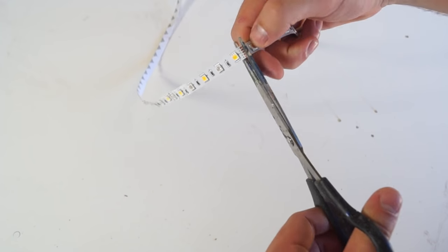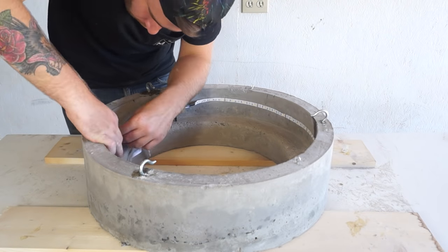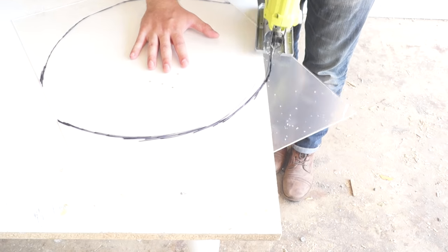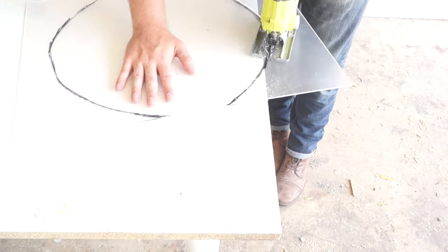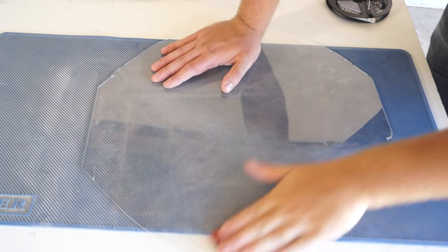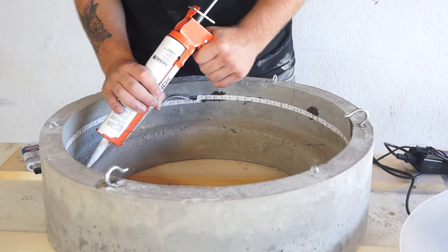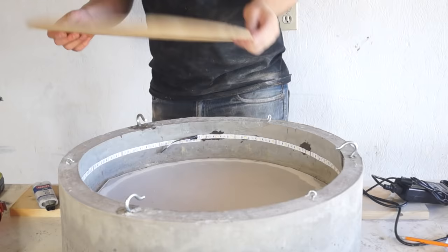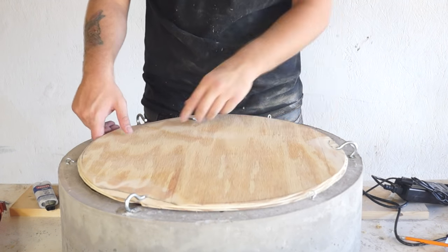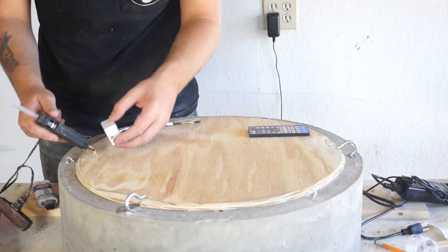While I let that dry, I got my LED light kit from Amazon and installed it — I'll have product links to everything in my written article. Next, I got a piece of acrylic or plexiglass and used a specific jigsaw blade for plexiglass and cut it into a circle. This doesn't give me the absolute cleanest cut, but it was a lot better than using a different blade. I wanted to diffuse the light from the LEDs so you wouldn't see each individual LED, so I used 220-grit sandpaper and sanded each side of the glass. Then I used some silicone caulk and just laid it in and let it dry. I also got some scrap plywood and made a top for the light so all the light wouldn't spill out from the top — it also gave me a place to mount all my electronics, which I set in with a little bit of hot glue so I could still move things if needed.